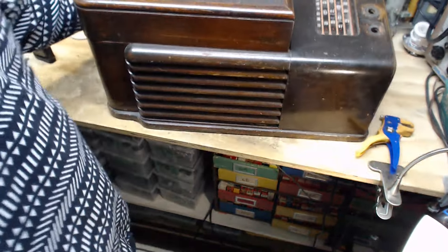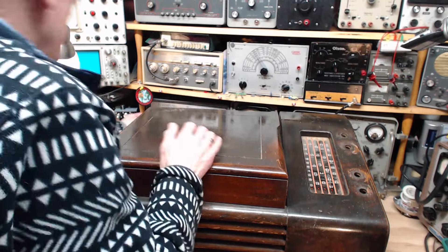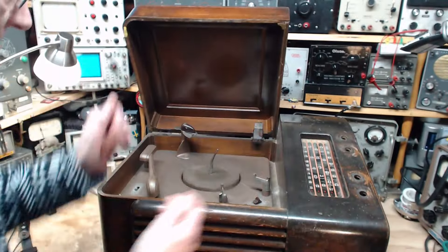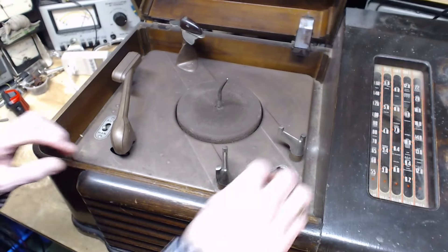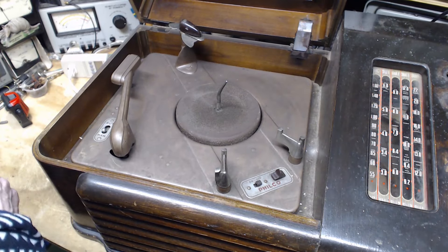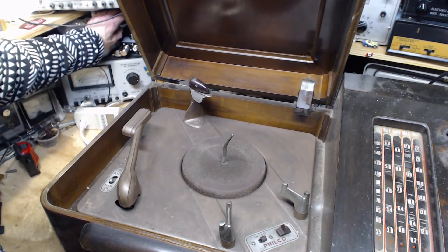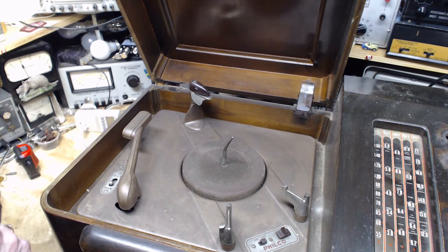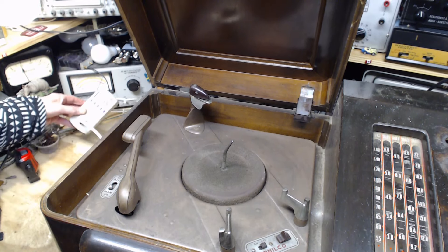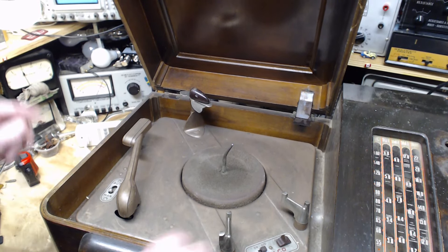Okay, that's a beast. Let me just make sure this is okay — as long as we don't move it the wires will be fine. If I raise the camera a little bit you'll be able to see the two dim bulbs. Nothing should happen at all when I do this. Nothing has happened — the supply is showing 116 volts which means the switch is open. I'm going to cut the power and put the switch on.